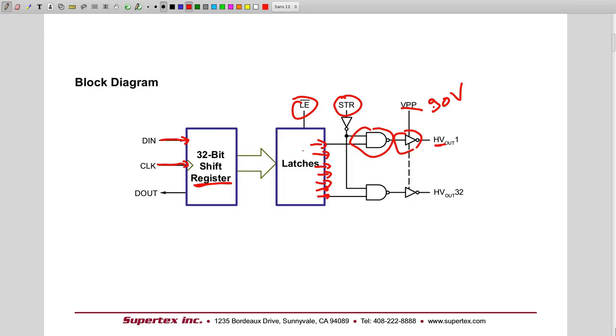And we saw we have three of these chips. So we would want to control three of them, but instead of having three times data in and three times clock, what they did within the design is also provide a data output. It takes the 32 bits which you shift in, but if you shift even more bits, then whatever went to data in will go to data out. And then the clock is shared between all. So here we have one chip and then you will have another chip, and the clock is shared between all of them, so they are synchronized. This way you can chain as many of these display drivers as you want. We have three of them which just share data in, which is then forwarded, relayed, or chained, and then the clock. And that's basically how it works.